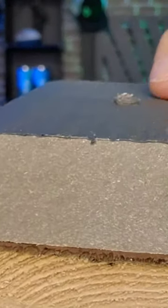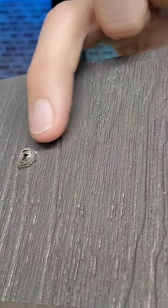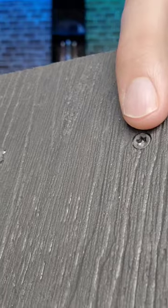But when we get to the top, we want that screw to grab all that excess material that's been trying to pull out and have it suck back down, so the screw finishes nice, flat, and flush and looks great. The wrong screw causes a big bulge of material to mushroom up and push out. The reverse threads stop that from happening and give a much cleaner finish.